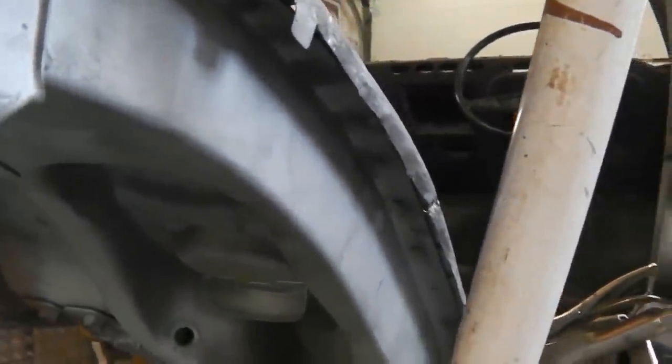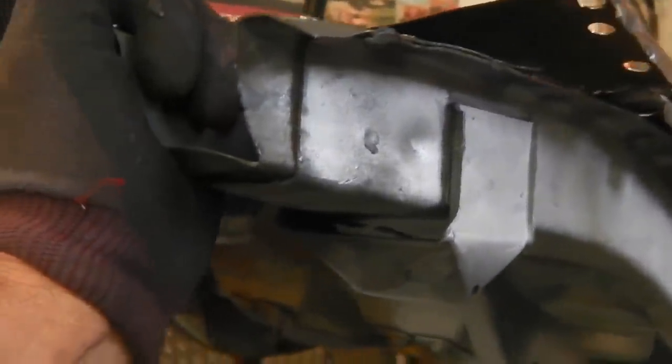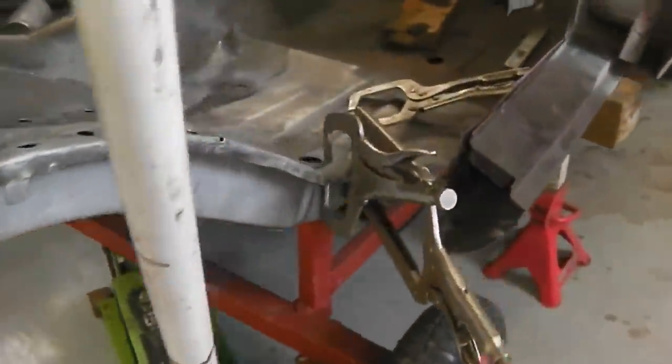It wants knocking over to the right a little bit, I'm not going to pay attention too much to this piece because I grafted that on. In terms of the alignment of the welds, they could be different. Well, having said that, they are right. It wants to come across to my right a little bit, but I've only just clamped it up. Then you'll see what I mean about these welds. Look at the holes, how they're landing in all the same places as the others.